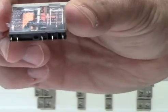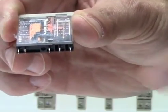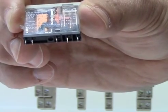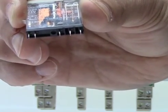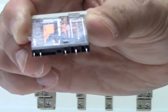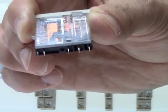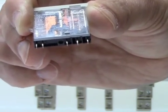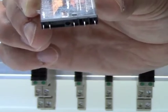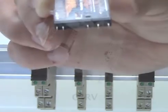which can handle up to 6 amps at 250 volts. Regarding the pin configuration, we use a terminal style pin and not a PCB style pin. The reason for that is that it allows the relay to be mounted into the socket without bending the pins, making it a much more robust 6mm style general purpose plug-in relay.